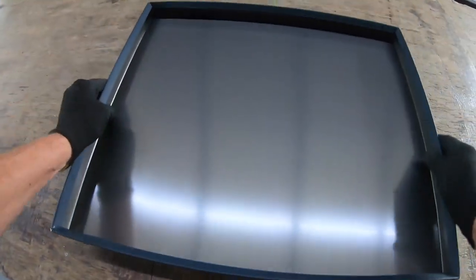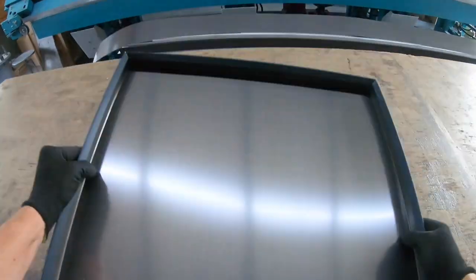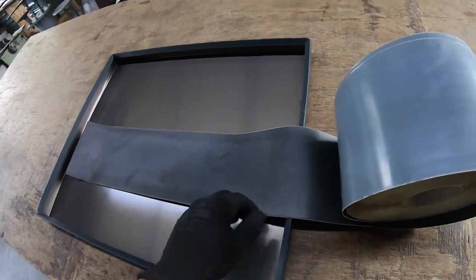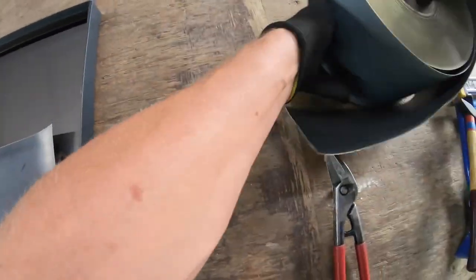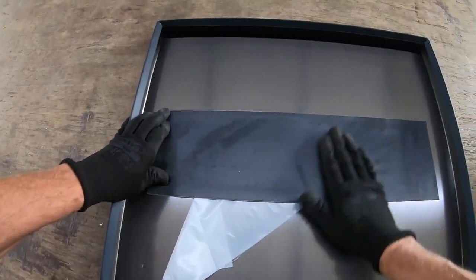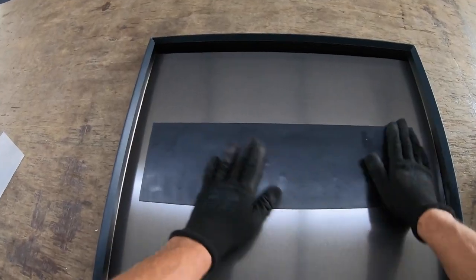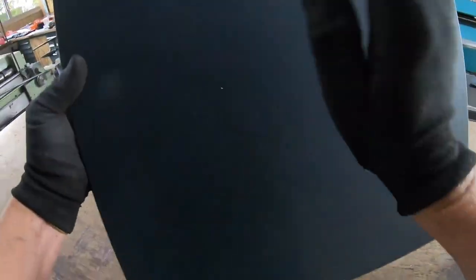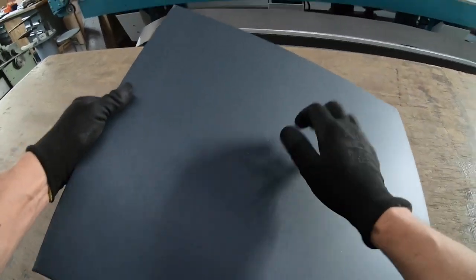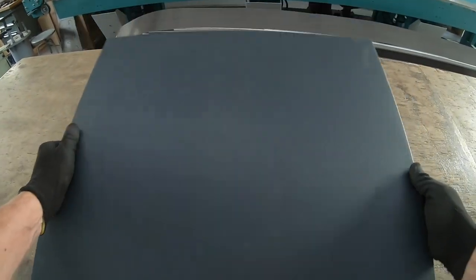Very cool. For soundproofing, so that the whole thing doesn't clatter like that, I now have another soundproofing tape here. Actually, one strip is enough here, glued in the middle. So you can pull it off here like this, then we just pull it out of there. And then you don't have such a bright sound. Basically, the bright frequencies or the high tones are then practically damped a bit. And then you no longer have this extreme rain noise.